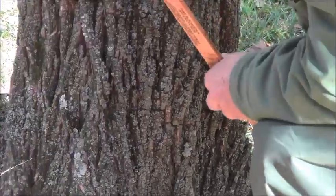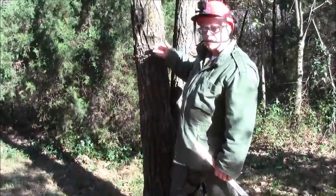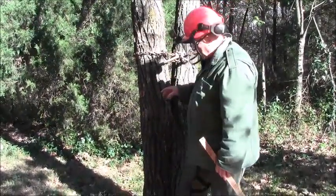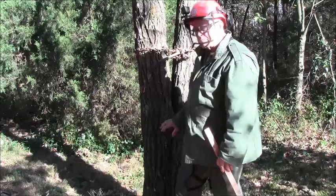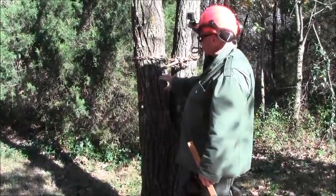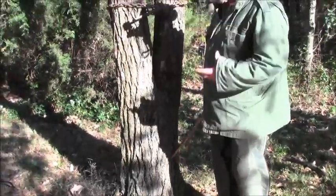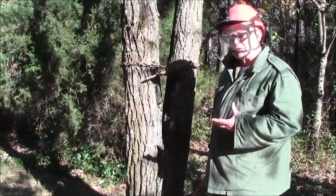So remember that. We're going to set this tree up into 10-inch segments so we can figure our back lean and see if we can handle it. I'm going to have a good solid 10 inches, maybe more if I make everything right, but we're just figuring on 10 inches. I know I've got a good solid 10 inches. So that's going to be our segment size for wedging.